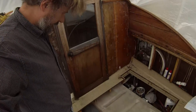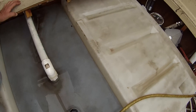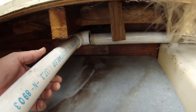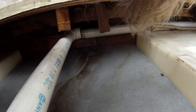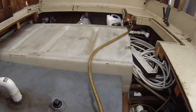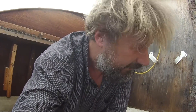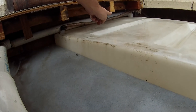After a few minutes with the hose I've slightly reduced the disgusting factor, and it allowed me to do some research and figure out what's going on. I can see that the pipe has come off down there — it's just a solvent-welded fitting, so that's a pretty easy fix if I'm going to retain any of this. But I really don't know right now. If I pull up these tanks and all the plumbing and support that goes with it, that's a pile of work. In some ways the tanks are low enough that I can put new structure in for the new floor, because my structure won't be any deeper than this.